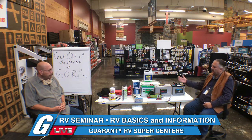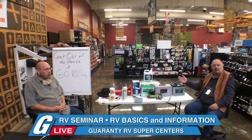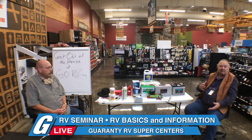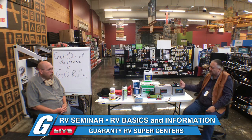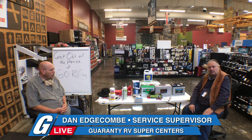These batteries like to be charged at about a third of their capacity. So if it's 80 amp hours, they want to be charged at 25 to 30 amps per hour — it takes about three hours to do a bulk charge. Then you want to let it sit for another hour to relax and float and finish off that charge. So it takes three to four hours to charge a battery.